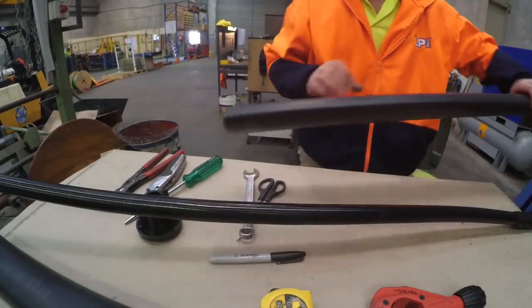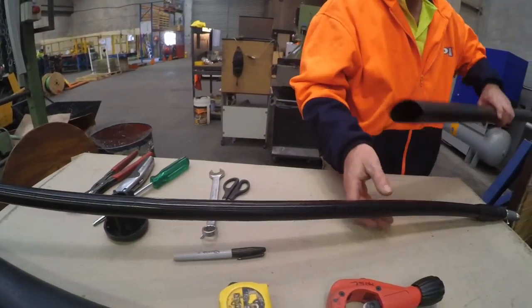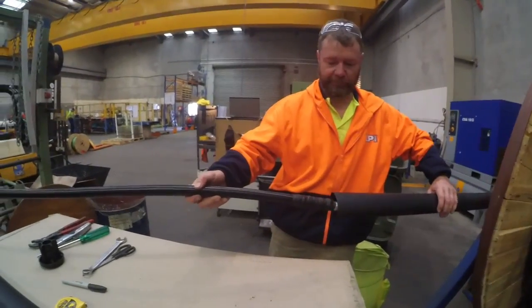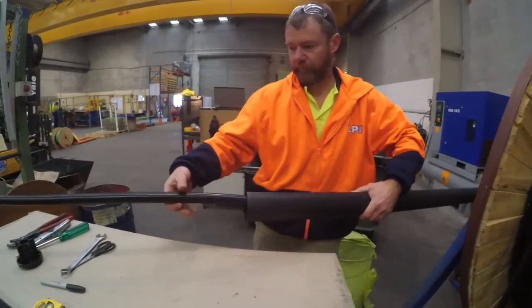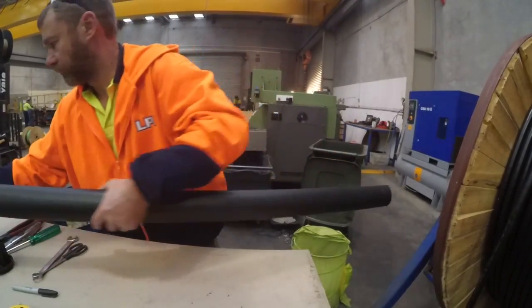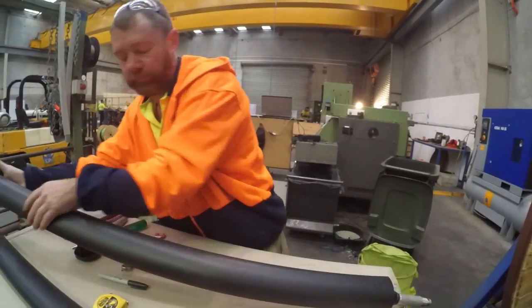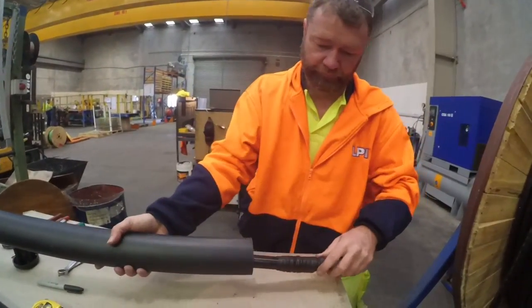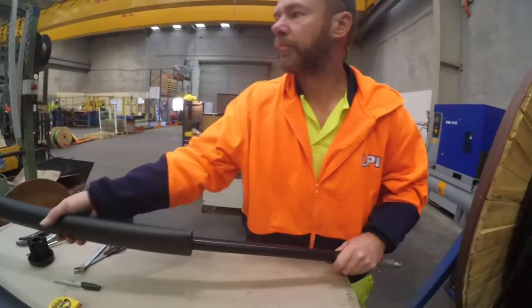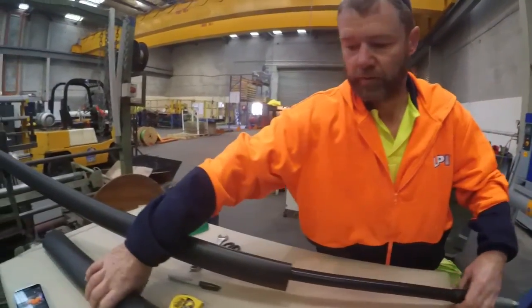Remove the plastic mast butt adapter section of the mast base assembly, if fitted, by unscrewing the M6 Phillips head screw on the side. Straighten the cable as much as possible, then carefully slip the first 1.2 meter length of heat shrink over the cable until the end of the heat shrink tube covers and overlaps the semiconductive tape over the black outer sheath by at least 3 cm.